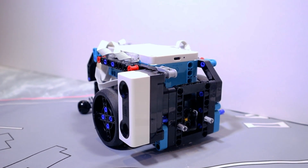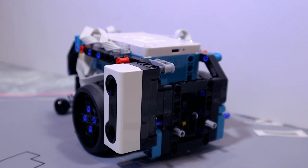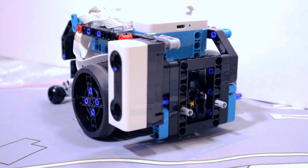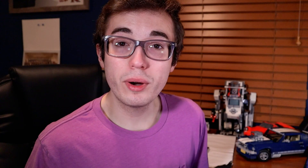If you're not already super familiar with the ultrasonic sensor, I recommend you check out the video I published last week, where I go into detail about how this sensor works and what exactly it does. The algorithm we're making today is called a proportional wall follower, and it uses the ultrasonic sensor to measure distance and maintain a fixed distance from the wall. You mount this sensor on the side of your robot facing the wall. For best results, mount your ultrasonic sensor vertically on the side of your robot and close to one of your drive wheels, as shown. This helps your robot more accurately detect changes in distance from the wall, especially if the robot is approaching from an angle.